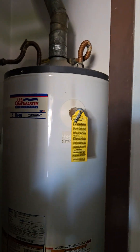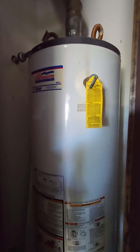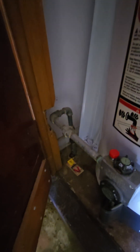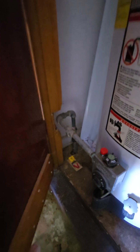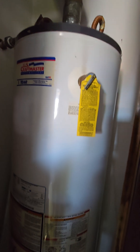There are a couple of things in this hot water tank I wanted to share with you. One thing is that I don't have a drip leg from my gas line — that's to help catch any kind of debris coming through. I also don't have drainage on my pressure relief valve, no tight pipe coming off of it, nor a diversion or a drip pan.